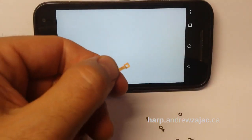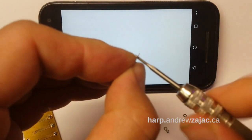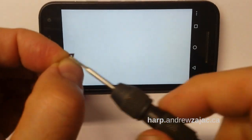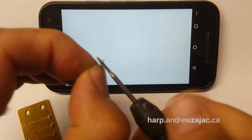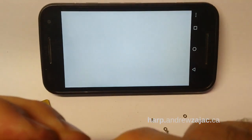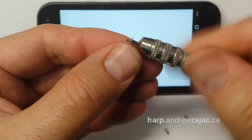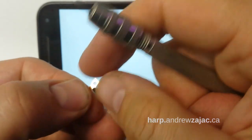Here's the reed that I've taken off — we're going to enlarge the hole. Here's an M1.4 tap. I've tapped the plate with this reed, and I'm also tapping the base of the reed. I'm also going to use an M1.6 tap, which is a little bit bigger, to enlarge that hole. Finally, here's my 1/16th of an inch drill bit to enlarge the hole further. It's a couple more steps than just using a drill press, but it saves you from having to use one.